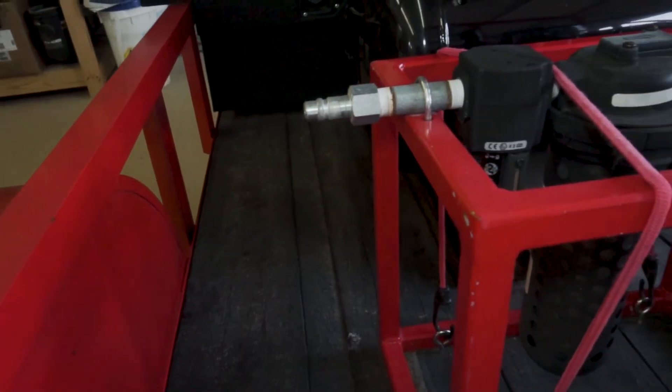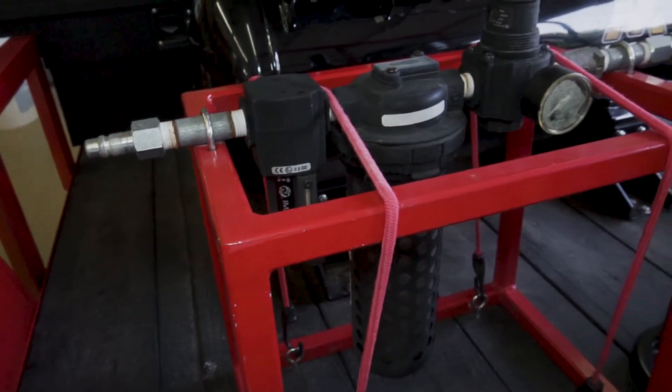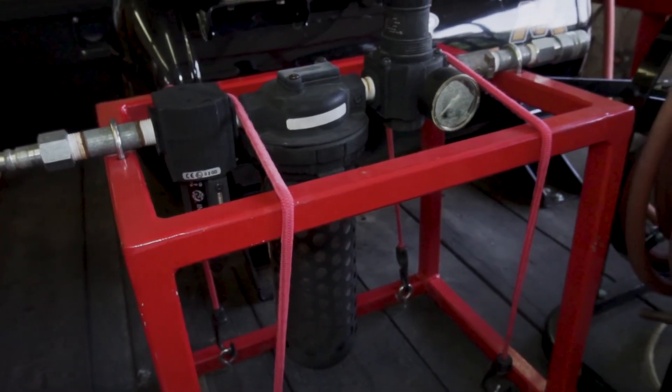Coming off the compressor, your air hose connects to what's called an air dryer. I did not know how important this step was — I didn't even know this part existed when putting together my rig. When the compressor compresses and releases air, it gets moist; there is actually water condensation in that air. The air dryer has beads in it that dry the air, preventing moisture buildup and clogging in your media hose.